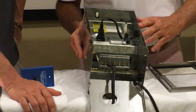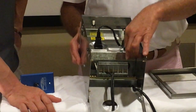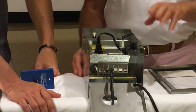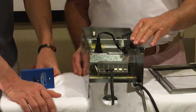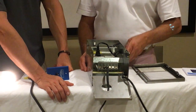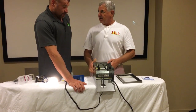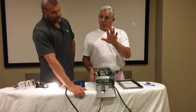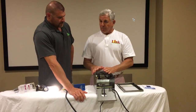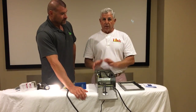This is a 300-watt transformer, by the way, folks. Two commons. They start out at the 11 and go up to the 14 tap, and it goes up to 22. Here's the key: don't overdrive LEDs. I know there are a lot of manufacturers saying put it on the 15 tap or run it wide open. We're telling you, don't do it. It'll cause the bulbs to strobe, shut off, it'll burn them up. Don't do it.